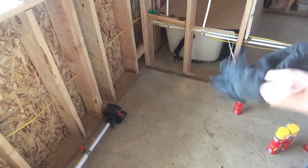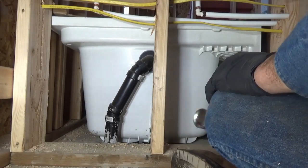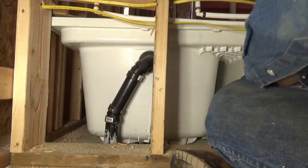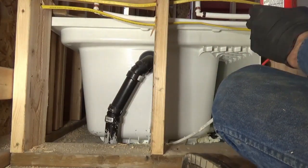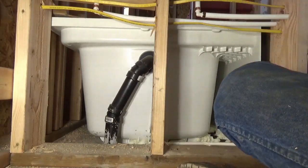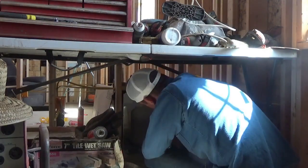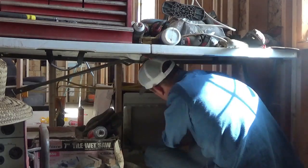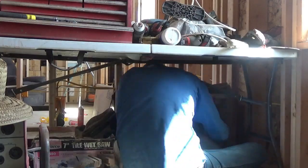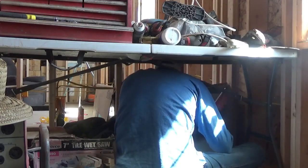With an acrylic or fiberglass tub, the skirts on the front of the tub are also prone to moving around a little bit. By taking a piece of three-eighths poly pipe and a little bit of electrical tape, it fits perfectly over the end of the can of spray foam. I put the two-by-fours in front of the tubs to prevent the skirts from moving away from the tubs as I foam them.